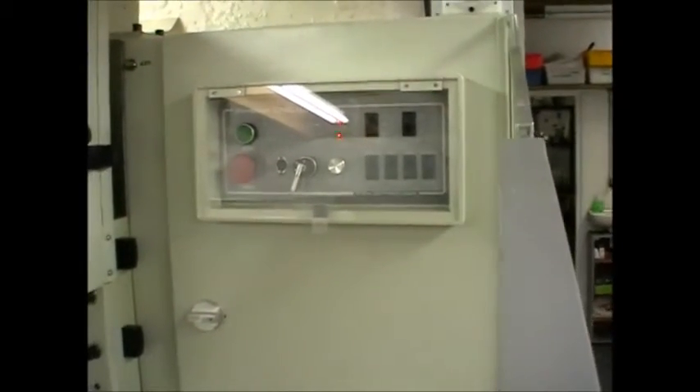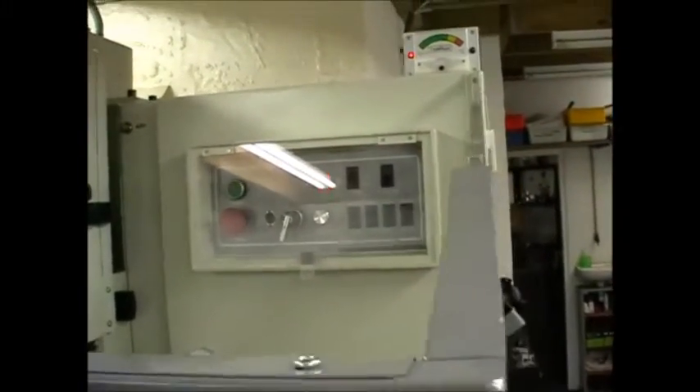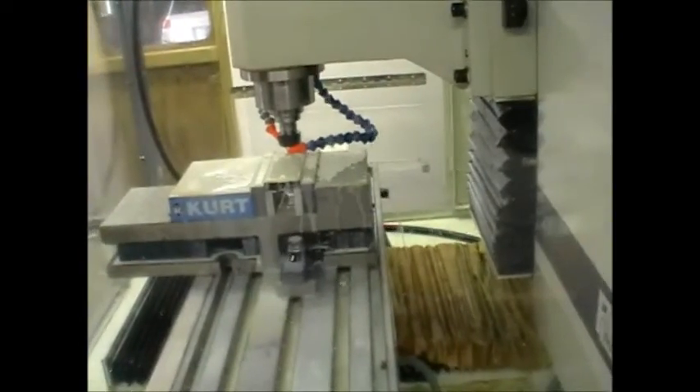I've got my electrical cabinet controlled flat down in case there's any stray coolant going in there. There's a view of the sliding doors to the side where the drawer slider is. It just hangs down there with a very simple guide system at the bottom that shouldn't be affected by chips.